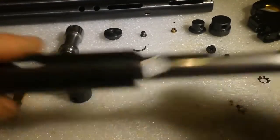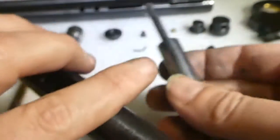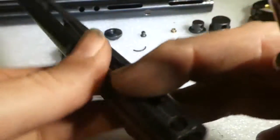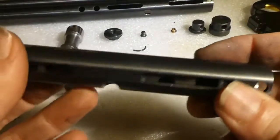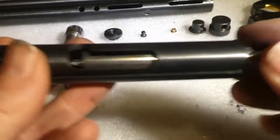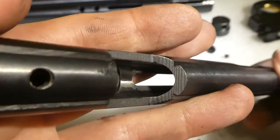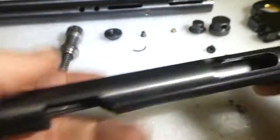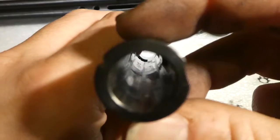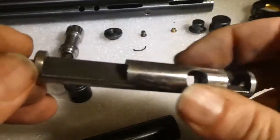They're not a particularly good tight tolerance fit to begin with, and I don't want to take too much material out in case it becomes too sloppy and starts twisting in the cylinder. I've polished it down as best I could so the actual resistance is a lot less than it was — it was proper gritty. Just a bit of 500 wet-and-dry on a stick and twist it through. Be very careful how much you actually take off — you basically want it smooth with no jagged edges, just so the bolt passes through nicely.